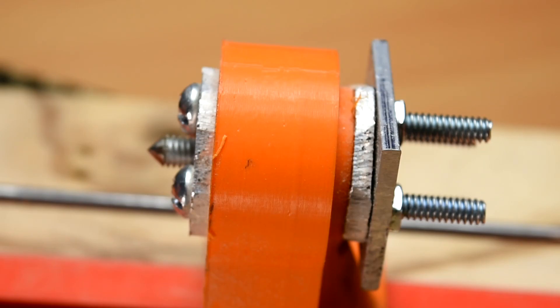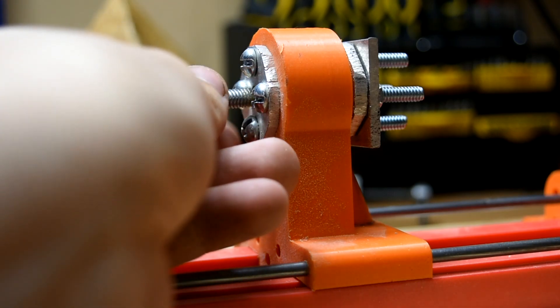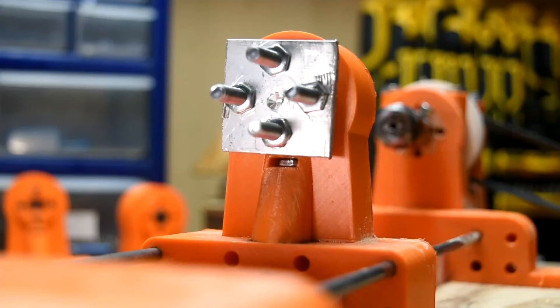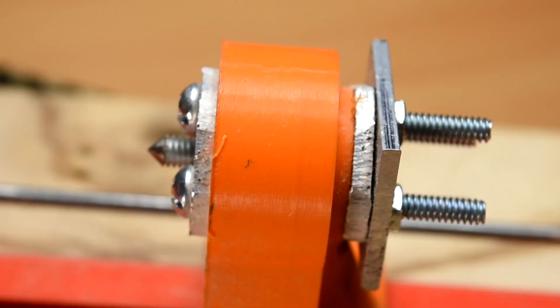To fix the second issue, I made these aluminium plates that make it harder for the live centre to rip out. Two of the plates have a 6mm hole in the centre to guide the centre at the front and the back, and the back piece keeps the centre in place. There are still bearings between the plates as well. These pieces are easy to make — I only used a cordless drill, a hacksaw, and a 3D printed template which I clamped to the aluminium. I've done a lot of turning with this setup and had no issue or sign of wear.